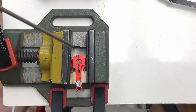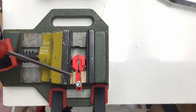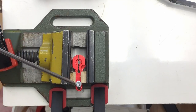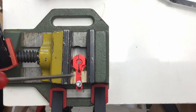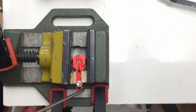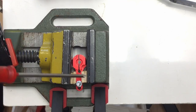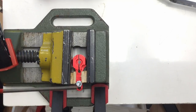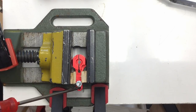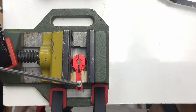It was quite hard for me to get a grasp on that servo arm, but yeah, lots of shimming involved, and in the end I managed to do it. I also put in a screw here with washers on the top and the bottom, the washers being steel, the servo arm being aluminium, so that hopefully keeps me from sawing into the meat that I actually need later on.